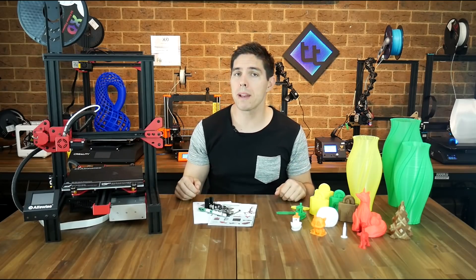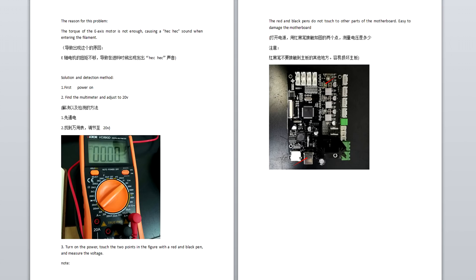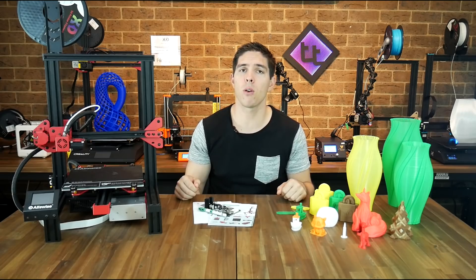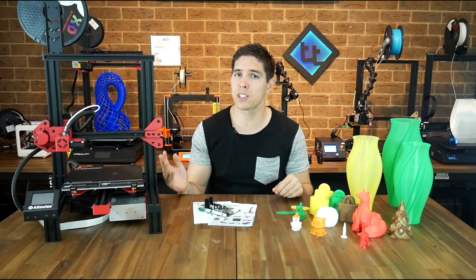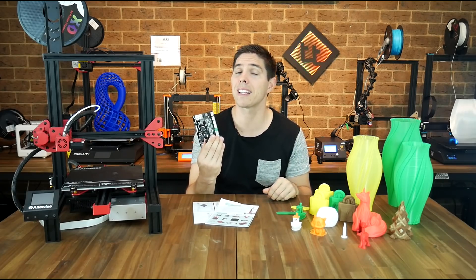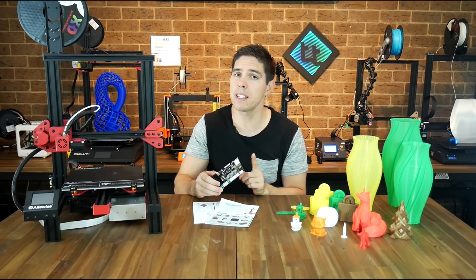At this point, I thought it would be best to contact Gearbest to see what they had to say. They sent me through a help file with instructions on how to lower the VREF for the extruder. I thought this was great because it's a process I've done many times before, so I confidently lowered it to the value they asked for. But the first time I tried to extrude after doing this — bang — this thing caught on fire. Luckily, I was sitting nearby. You can see the damage from the smoke and flames on the nearby components. It's safe to say that the stepper motor driver must have been defective from the start, hence the under-extrusion.